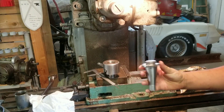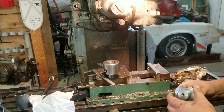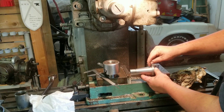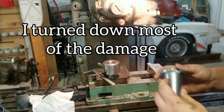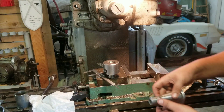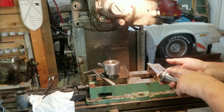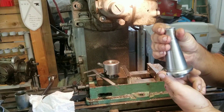I meant to show you guys the milling of the drive dog slots on here, but I didn't press record — and that's a 25-minute montage of me cleaning the mill up, wasted. I did have a couple of boo-boos: I held it in the vise and came in with an end mill, and whenever I came in it caught and twisted. You might be able to see some serrations here — it just caught it and wasn't held in the vise as tightly as it should have been. Then when I went and did the other side I got quite a bit deeper, and it caught and twisted, broke the end mill — it was very gnarly. So I just milled it down and put my name on it.